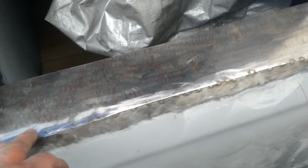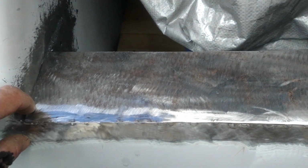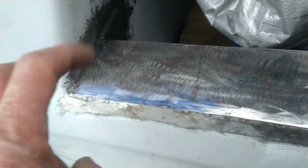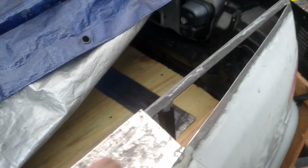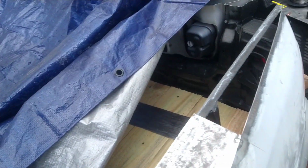All right, boys, so I threw a couple spot welds in the middle. I don't want to warp it, so like every other spot I grind them down. Still gotta weld the back, but what I'm gonna do, I'm gonna finish welding that small piece, and I'm gonna see if I have bondo glass, and I'm gonna fill it in now, so we have a coating and I don't have to worry about rusting in that part, and it's protected. The pre-body work is somewhat finished on that, where we could just sand it, prime it, pretty much done. So that's what it's looking like. Let me weld this piece so we could finalize this side, then off camera we do the other side. You already know the deal, so let's see what it looks like.